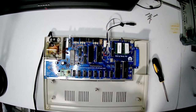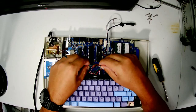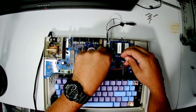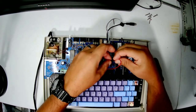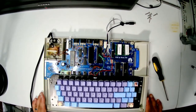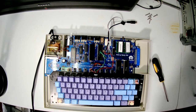So this keyboard is a nice aftermarket keyboard. This is a Mr. Dave 6309 Cherry CoCo keyboard. And it's got a nice little thin PCB here that goes into the Mylar ribbon connector. Then it's got two leads to power LEDs on the board. I've temporarily hooked these up this way. So let's see if they actually plug in, because I think I might have messed up the connector. Okay, seems to grab enough. It's a nice looking keyboard. Again, a Mr. Dave 6309 Cherry CoCo keyboard. Very responsive, nice feedback, just enough click.